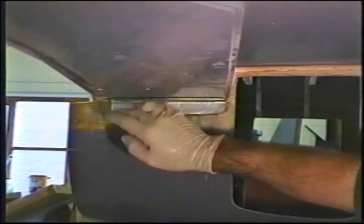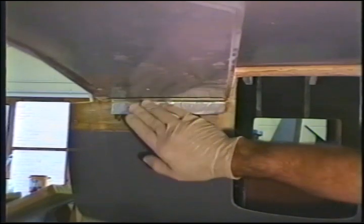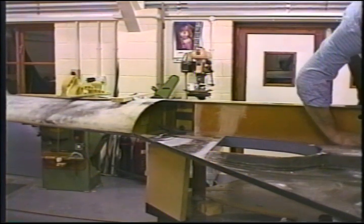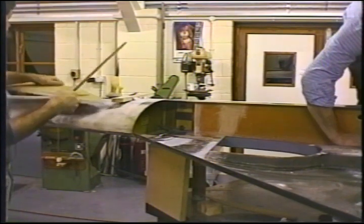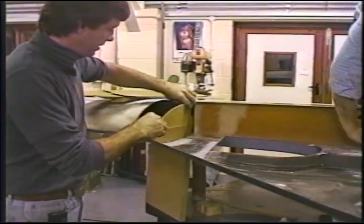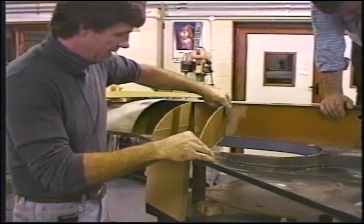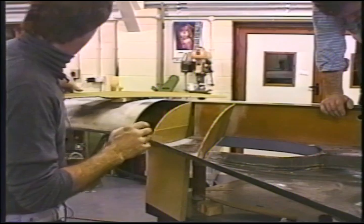Just do all the standard stuff. Brush on the resin, rub the foil. We've generated 3 airfoil templates that represent each position where the ribs go. Now you will receive these templates and won't have to go through this same monkey motion that I went through.